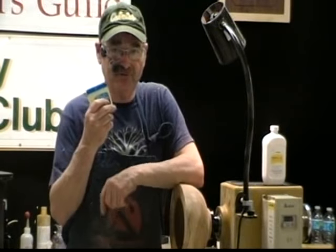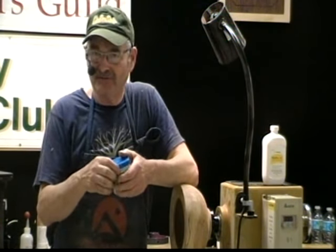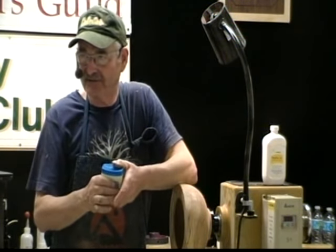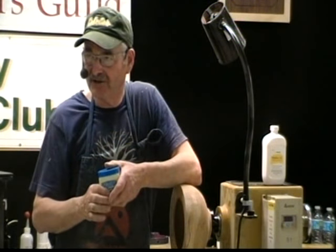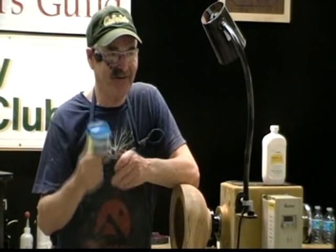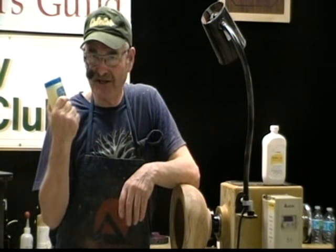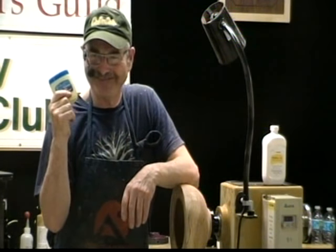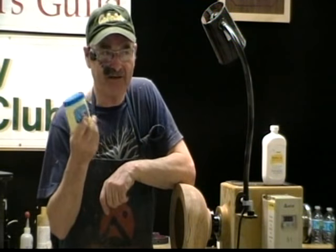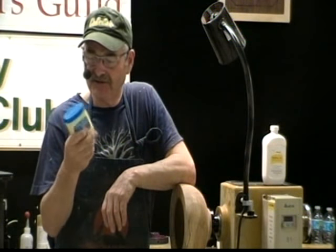If you're going to make a bowl and use it for fruit or porridge or stew or whatever, and you turn the bowl and you sand it, and you want a quick finish, there's your man. Rub it in, give it a spin, that's it. Your bowl is ready for use for food. Again, very safe, right? Penetrates and is waterproof, obviously. And it is absolutely brilliant.